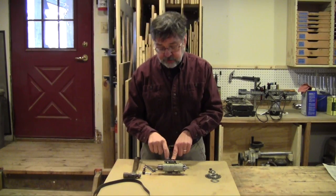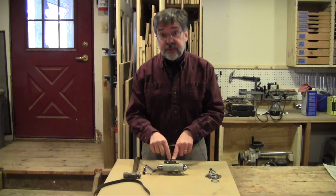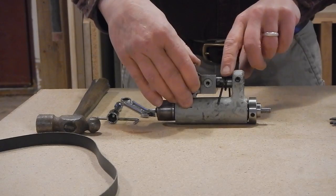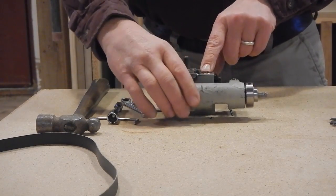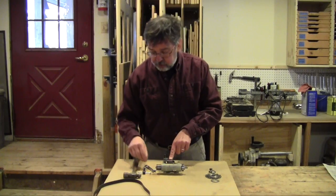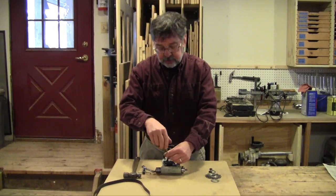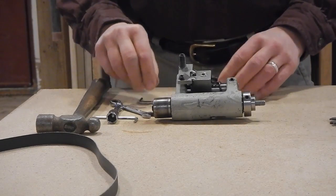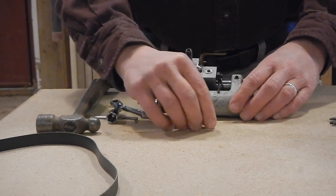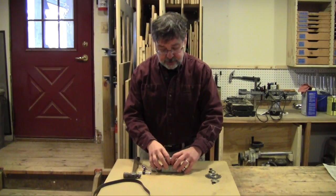In order to remove the scoring support sub-assembly from the larger assembly, we first need to remove a couple of little pieces that will prevent this block from sliding along the shaft it's mounted on. That shaft serves as a hinge that the scoring shaft component pivots on. First we'll take out the locking set screw that's normally accessed through the top of the table saw and set that aside. And then a hidden component — a little brass hockey-puck-shaped piece — that we don't want to lose. If we left it down there it would get in the way later on.